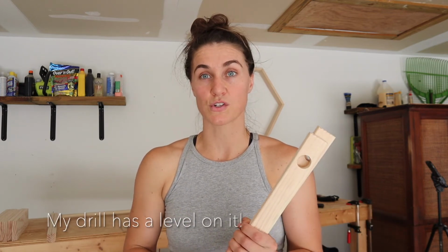Or if you want to be extra careful, you can drill halfway through, flip it over, and drill all the way through that way. But I just like to clamp it up like you saw on a flat board. And also I do that because I am not the best at drilling a straight hole. I went the good old-fashioned way, the drill and the Forstner bit.